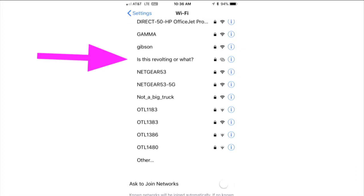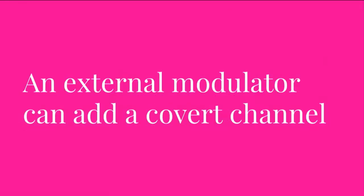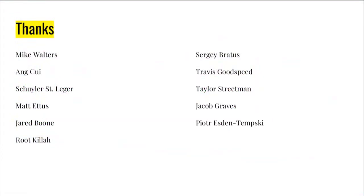But I'll happily run this somewhere a little bit more RF silent for people to try it out later. Essentially, we can take a radio test mode that transmits a pure carrier wave into this device. We can do binary phase shift keying, and I really do promise if you do binary phase shift keying at 11 megabits, you get a 1 megabit DSSS transmission out, and that can be crafted to be a Wi-Fi beacon, and you should be able to pick this up on your phone.